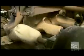There's only one pattern loaded, yet the machine carves out a pair of shoes. That's because the wheel on the far left spins in the opposite direction. So as the blade saws away, it's creating 2 mirror image copies. That allows the machine to carve out both a right and a left shoe simultaneously.